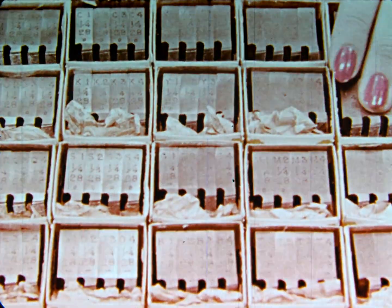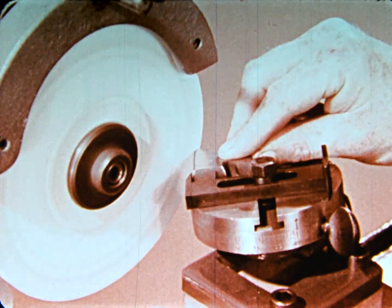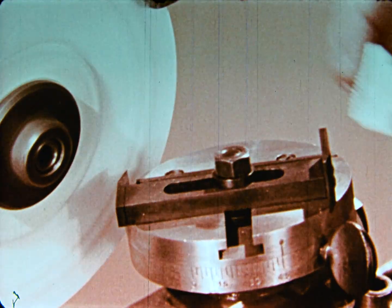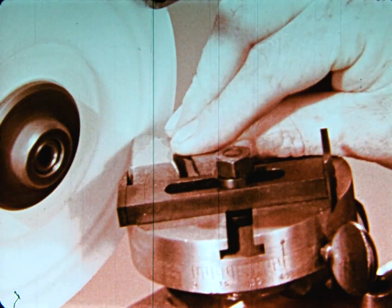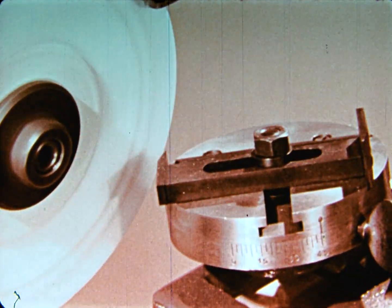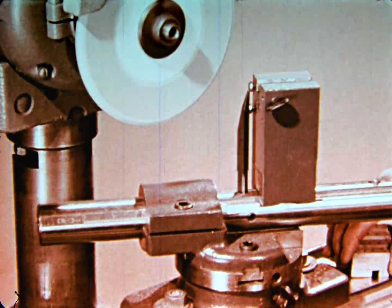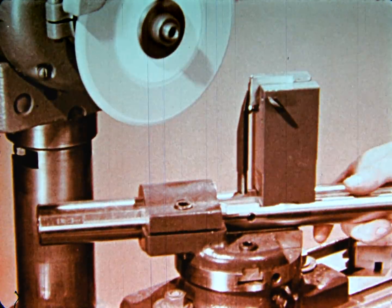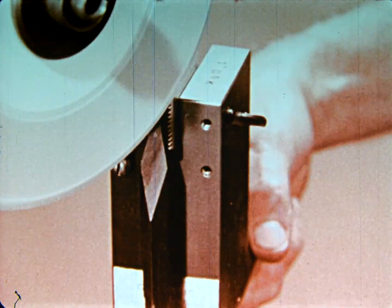Even the finest tools require sharpening after periods of hard usage. This is the Style A chamfer grinding fixture. With this single tool, either ground or milled chasers can be re-chamfered. The Style E universal chaser grinding fixture is designed for rechamfering all geometric type conventional radial chasers. It can also be used for grinding the cutting face.